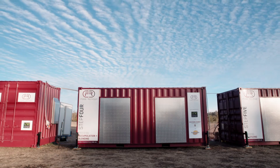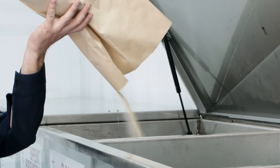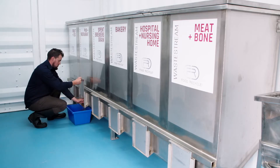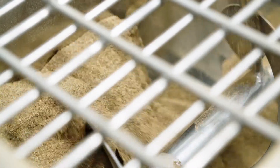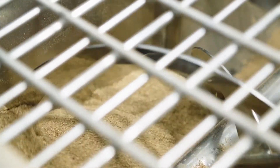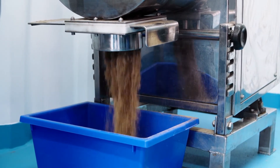Container 4 is accumulation and blending. The dehydrated crumb is passed through a hammer mill and then stored as a shelf stable fine powder. When the material is ready for blending, the correct proportions of powder waste can be collected according to a feed recipe. The ribbon blender ensures a homogenous mix. Minor ingredients can also be added at this point to enhance desired nutritional content and to meet the poultry feed formula requirements.